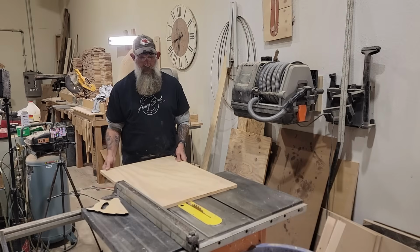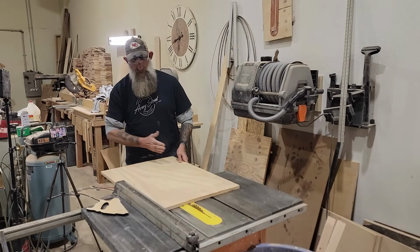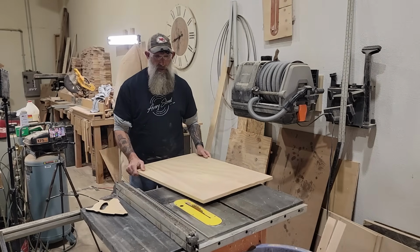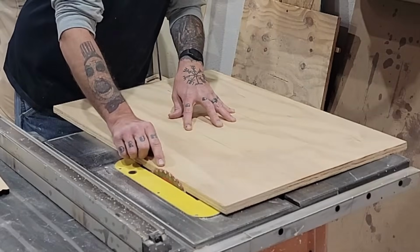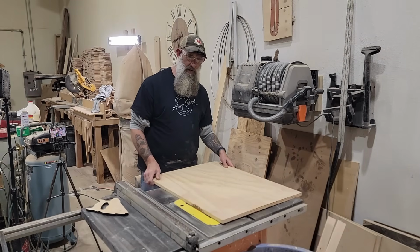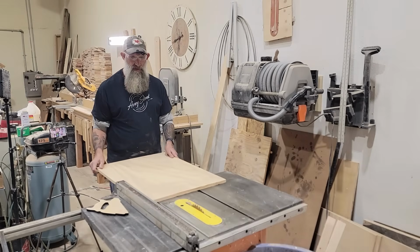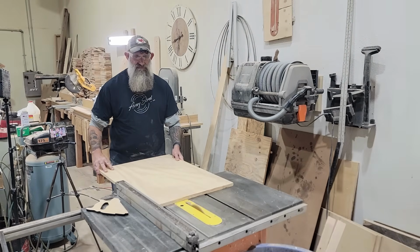When you're on a table saw, the safest place to stand is the side of the blade, because things kick back and could hit you right in the stomach, which has happened. Also, when you are setting your blade height, you just want it about 1/2 inch above the material you're cutting. If you have your saw blade up really high, it could grab that material and spin it right out of your hand, and then you've got a whole other problem. So stand to the side of the saw blade. So, general table saw safety, and safety glasses.